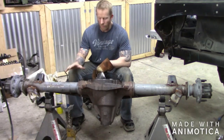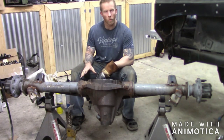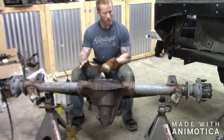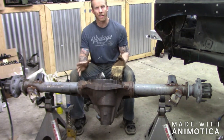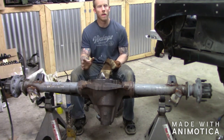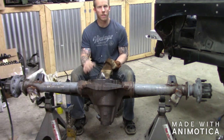We've got everything welded to the tube. All the brackets and stuff are fully welded. Now we can go ahead and weld the truss to the cast. It's already pretty warm — probably about a little over 100 degrees from welding everything. That kind of helps because you're going to heat this cast up to about 400 degrees. I'm going to use a couple of torches here and it shouldn't take too long.